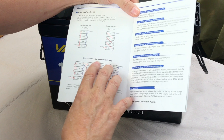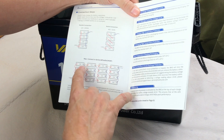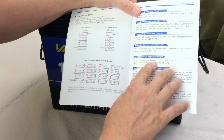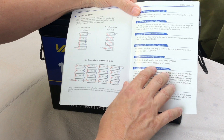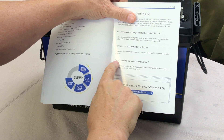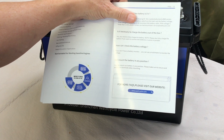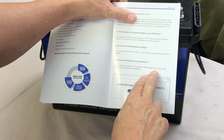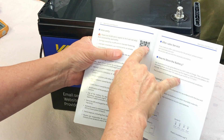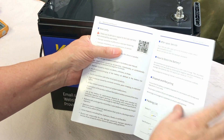The max connection in series and parallel is a 4-cell, 4-pack configuration. The BMS will not allow charging current under 32 degrees Fahrenheit, or 0 degrees Celsius. The battery can be mounted in any position. Make sure to secure and protect the terminals when mounting. Scan the QR code to register for your 5-year warranty.